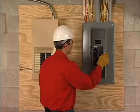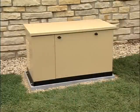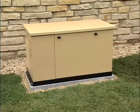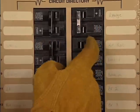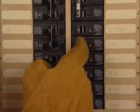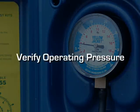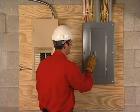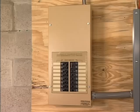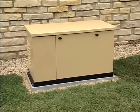After the generator has shut down, open the main breaker again to shut off the utility. When the generator is running and supplying power to the transfer switch, close the breakers in the transfer switch one at a time until the generator has accepted the entire load. With the generator carrying the entire emergency load, recheck gas pressure to verify that it's at the same level it was before you started the generator. Close the main breaker, and after a few seconds, the transfer switch will restore utility power. The generator will continue to run to allow the engine to cool down, then shut itself off.